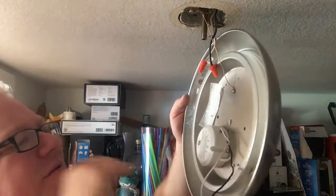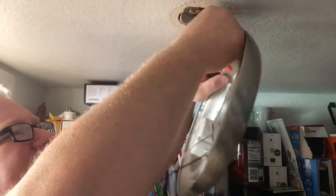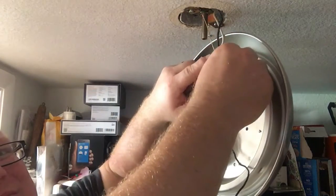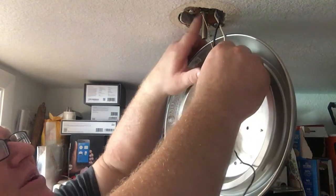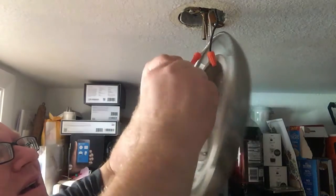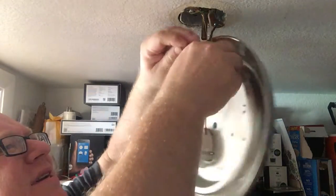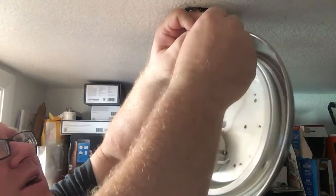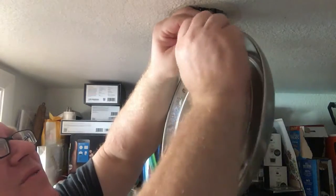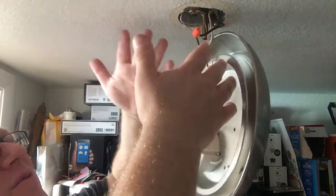This power supply is in a different spot than the other one, and a little tighter fit. It's not a bad idea, some people like to put the two different wires on one side of the bracket, the other. Either way is fine. I'm sure that if I was a real electrician, I'd have an opinion. I think the big thing is, were a wire to fray or come loose, a wire nut come loose, then you wouldn't want it to be anywhere near the other wire to spark.